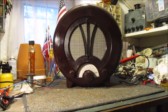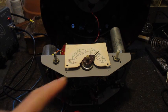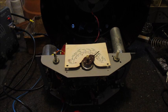I'll get my signal generator and VVM ready and warmed up before I get started. Okay chaps, it has now come to that time when I do an IF alignment as well as an oscillator tuning dial tracking alignment also. I did say that long wave tracking was way off alignment, and it still is. Yet surprisingly, medium wave was as close as damn it. Why the discrepancy between the two bands is anyone's guess.